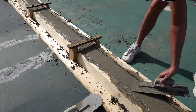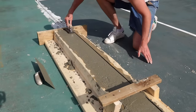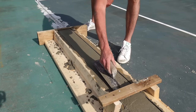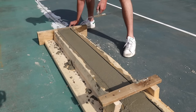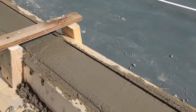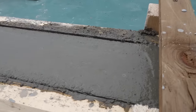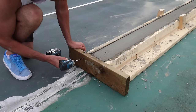The main purpose of the edger is to move all the large rocks out of the way and create the radius you're looking for. Not being super experienced in concrete, it was hard to know exactly the right moment to do that — the concrete needs to be supple enough to still push the rocks, but I've heard it also needs to be fairly kicked off before you start edging. My plan was always to do an early remove of the forms and then slick the concrete up right after it started to firm up. Right here you can see all the water rising to the top — it's still too early to pull off the forms, so we waited for all that water to soak in.